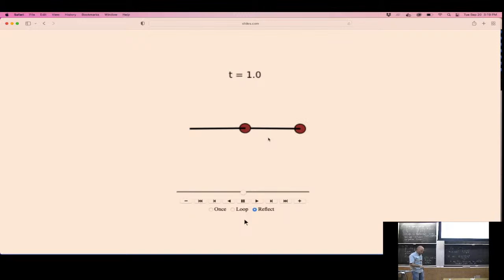So it is absolutely true that the map that goes from joint velocities to end effector velocities has a problem. You cannot invert that map at this configuration. It does not mean your robot is stuck there for the rest of time, right? I mean, with some controllers, it is. Okay, so we're not going to handle that case beautifully with the pseudo-inverse controller. We're not going to try to. We'll handle it in a different way, okay? But in the case where we're close to full rank, we'd expect this sort of pseudo-inverse to work well. The scary thing is when you get close to singularity, and then you start commanding very large velocities. Those are the kind of things that we definitely do want to address.